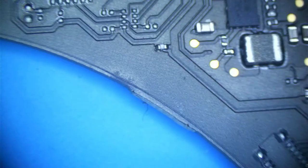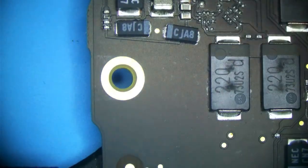So we're going to plug in a USB-C charge port here, and we are going to see what it does. Okay, shut this off so you guys can see. We have our splash screen. We have 5 volts and 0.0 amps. Now, typically on a pre-T2, USB-C board, that means that we have a short on PP3V3_G3H. Now on these boards, PP3V3_G3H and PPBUS_G3H, the voltage on DCIN kind of branches off and goes to both of them.